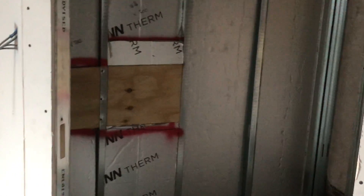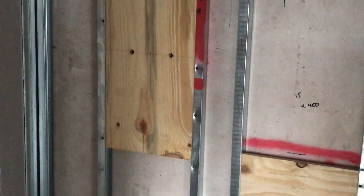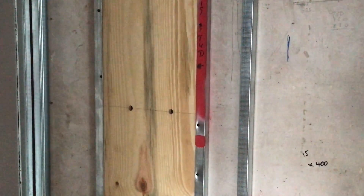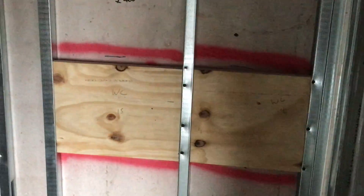We can also get a really good bathroom size within the space — it's about 1.6 by 1.6 meters square. As you can see in the bathroom, we've got ply in the wall: directly in front, that's for supporting the shower, the shower thermostatic bar, as well as a shower hanging rail. We've also got ply to fix the WC system onto.